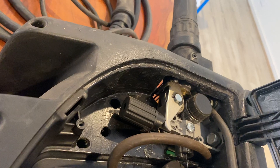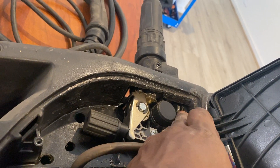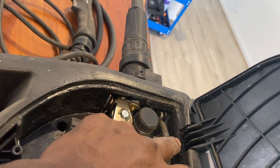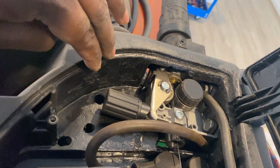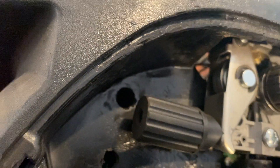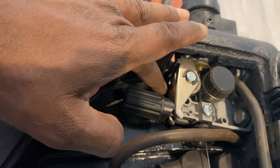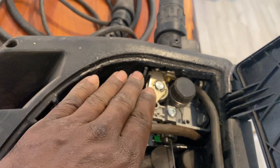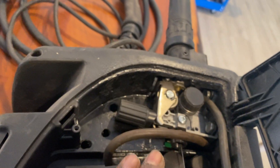The bottom has to be fully made as well. The initial one was empty so I got a bit of stainless steel mesh and a hot soldering iron — you can see it down there. I literally got the soldering iron and pushed that stainless steel mesh into the parent plastic, and then started epoxying the new parts. It took me about a good day to get the whole thing worked out.